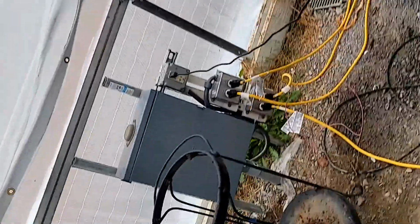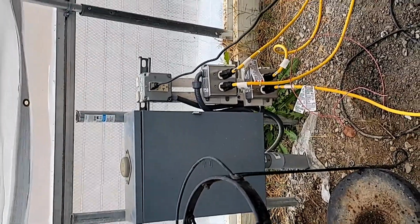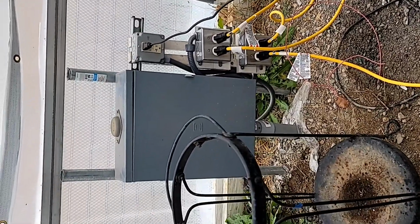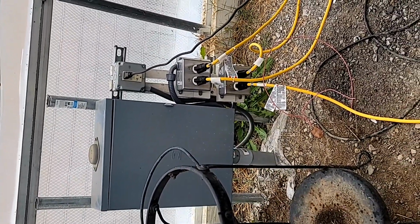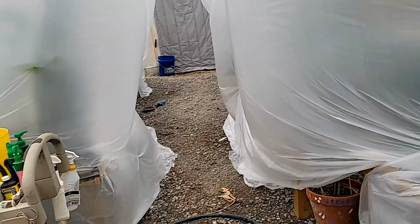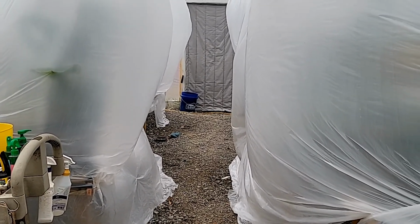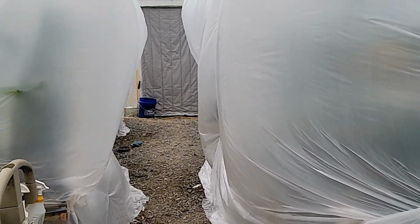And oh, here's the other end, just showing you my panel box that I put together. I've got individual breakers for each 8-foot baseboard, so if one goes out, 3 will still be working. And each one of those plug receptacles is wired directly to the board. It's not hot wired, so it's a very clean, direct situation here with how this is dispersed. And when I hit my thermal cam on the 8-foot baseboard unit, it's usually reading at the dead cold about 121 degrees. So it's not even like they're really pumping that much heat out.